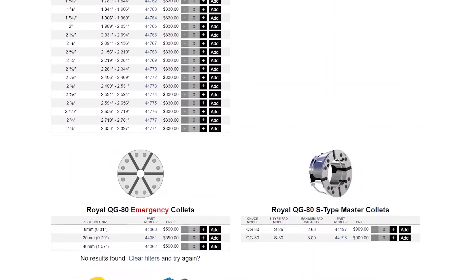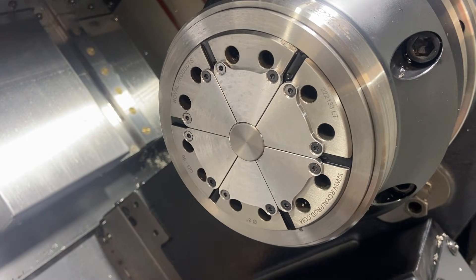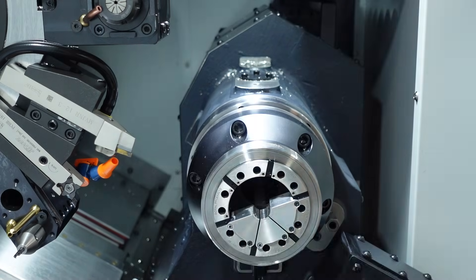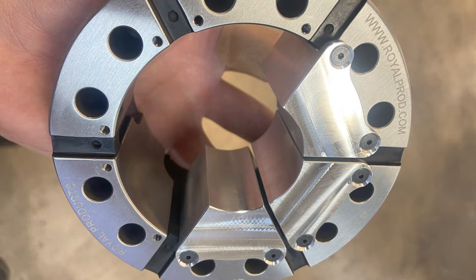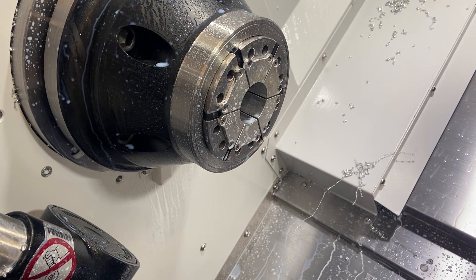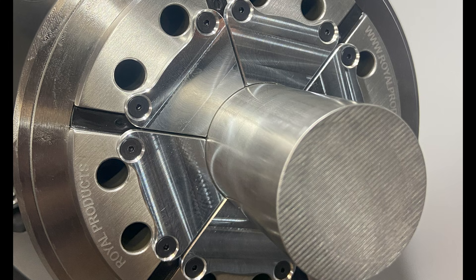I didn't want to pay that much money just to hold a new bar diameter. So we made this system of aluminum jaws where we added tapped holes to the face of the largest collet we have, which is 3-inch. We can just swap these jaws in and out with some screws on the face, giving us the ability to cheaply make any size we need as well as any op-2 geometry we need. We basically use this fixture pin that comes from Royal, lock down on it, and then bore the jaws out to whatever you need. Here are some inch-and-a-half diameter ones we made right off the bat for a job, and we haven't had any issues with them. Really proud of that — it's saving a lot on the financial side.